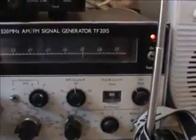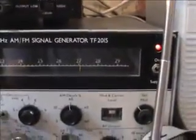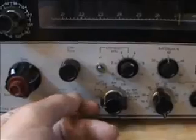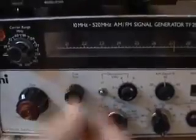So we'll just sweep across the band. Carrier is on, isn't it, yeah. There you go. You get what I mean? If I turn it off now, look. Until the first loop gets its head together. Are you with me? So I know now that I'm right on the nose of that signal there, 27175 or whatever. If I were to couple up my counter, I'd be very close. And I can set the level at the generator to whatever signal I want it to produce, for accuracy, you see. Anyway, let's put the radio on the bow.